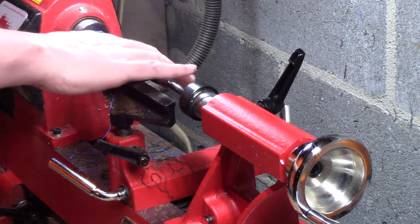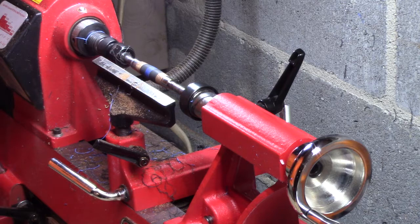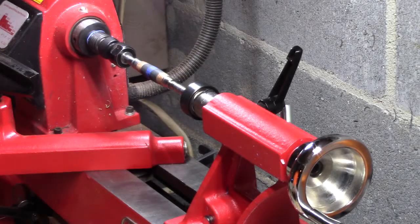It's pretty smooth there — get it ready for some sanding. Take a little bit of dry sanding and then put some CA on it to cover the wood. I'll have to put it all over it just to make it evenly shine. We'll sand it to about 600, take a look at it and see how it's going to look before I put some CA on it. Put a few coats of CA and then do some wet sanding. I don't want to get too rough with it and stay on that alumalite too long with this dry sanding because I've never dry sanded alumalite and it's kind of a soft material — I don't really want to take away that much of it. But I do want to hit the wood and smooth it out so I can get some of the scratches out.